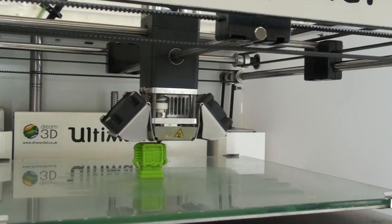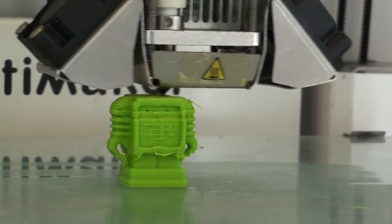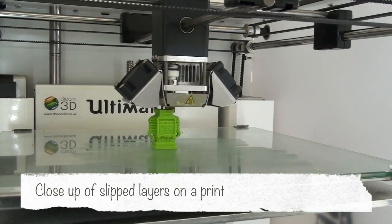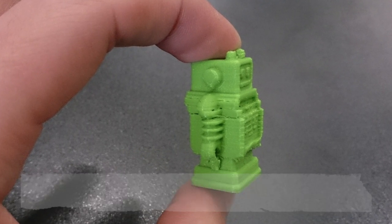You'll usually find this will happen in one direction, so it's worth making sure you check every single grub screw when you're looking for the culprit, just to be sure that you get the right one. It could be a fraction loose, so it might not be that obvious.